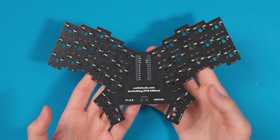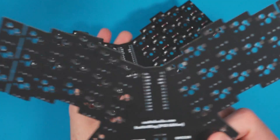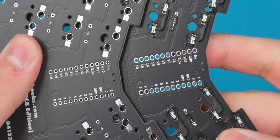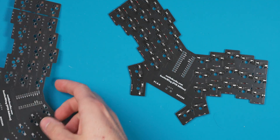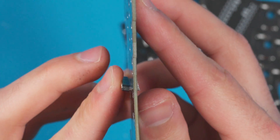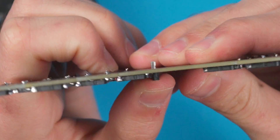All hot swap sockets are on the board. Now let's talk about the controller sockets. You socket the controller so that if it ever breaks, you can easily remove it. You might notice the holes here are quite a bit larger than on a typical prototype board — I designed them this way so the sockets sit completely flush and don't wobble around during soldering. The kit includes sockets with a pointed end; in the modified holes they sit flush and a little lower. I'm going to solder those on now.